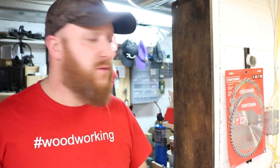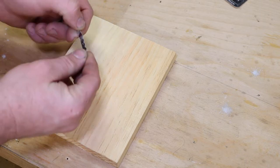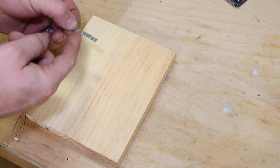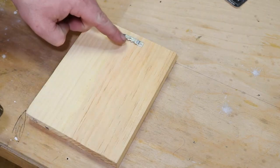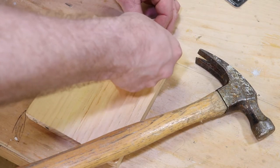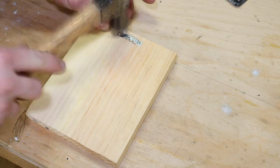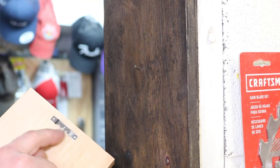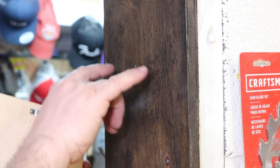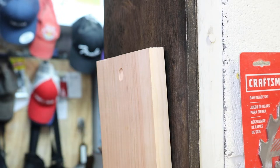Another way, while you're still utilizing the nail, is to use a sawtooth hanger. We've all seen these little things on the back of picture frames for many years. I just used these on a shaker peg shelf that I recently made, and they're very effective — they can handle things that aren't extremely heavy, but they definitely do the job. You put it on the back of your picture frame, take one of the nails that come in the kit. They're a little hard to hold because they are pretty tiny. Just get it started with your finger and then hammer it in. Then to mount it on the wall, find the center of the sawtooth. If you have a picture frame that has two of these, measure in between them to find the right point, and put two nails that are leveled with each other. In this case with one, go to the center, get the nail to take hold of that, and you've got it hanging perfectly.